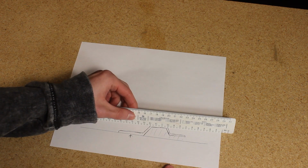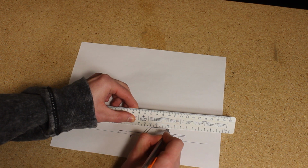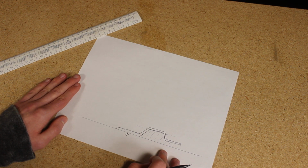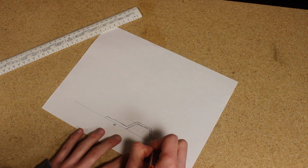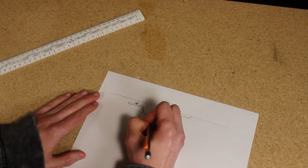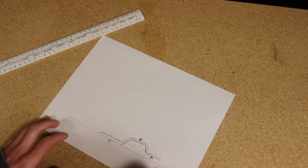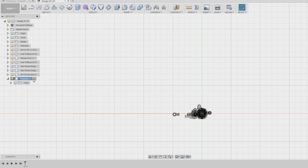One solution for this, and the one that I'm going to be trying out, is to split the model as shown so that it will be in 3 separate pieces. With this model in 3 separate pieces, each piece has a nice flat surface that can be printed directly on the bed, which should make printing easier. This chassis will also be able to be printed on smaller build platforms, require less filament due to the reduced amount of support material required, and there won't be as many rough surfaces on the underside of the chassis.